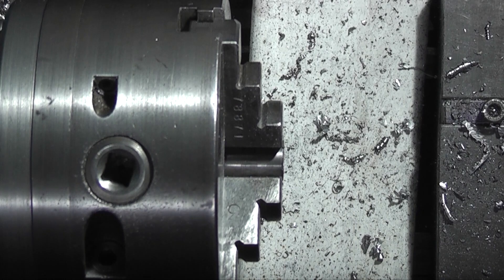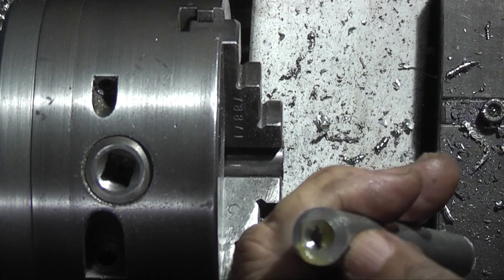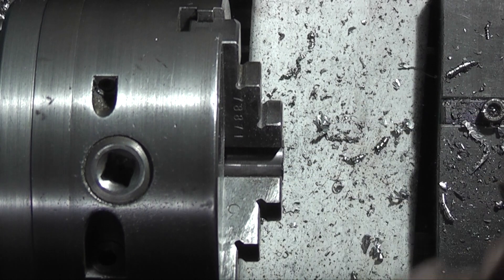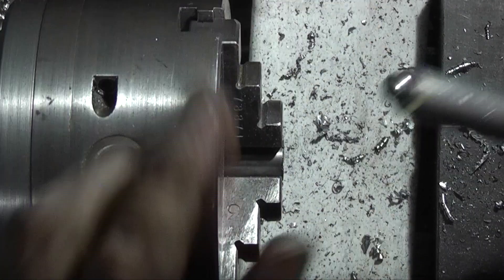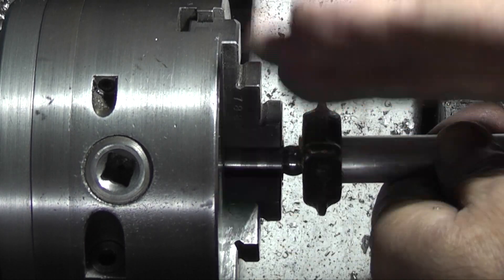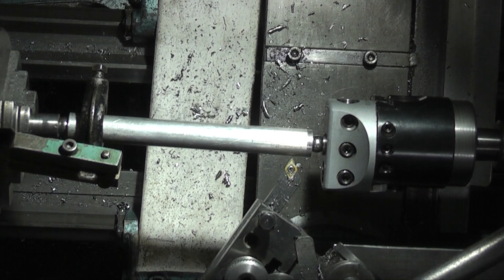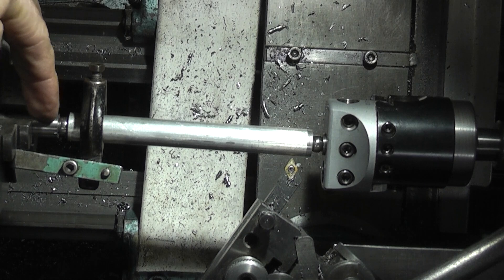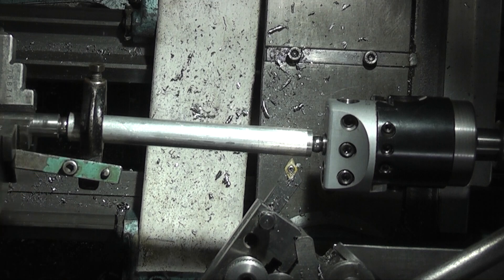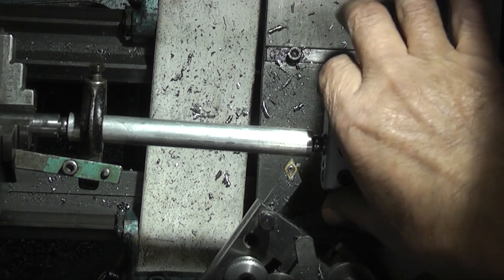I was hoping to show you how it would work but I can't find a carrier that I can use. What you do is you take the part that you want to turn the taper on. All I've done is put some grease in the end — that'll hold the ball in position. You put a carrier on here; all my carriers have a straight leg, I haven't got any that have the bent leg. You put your ball bearing in the end, a bit of lubrication — you shouldn't need much because it's going to go around with the chuck. I've managed to bodge up a drive using a three jaw chuck. There's the bar that we center drilled — ball bearing — the components. I want to machine a piece which has got a center in the end, another center, the ball bearing, and the small bit of bar I machined first, which is gripped into the boring head.